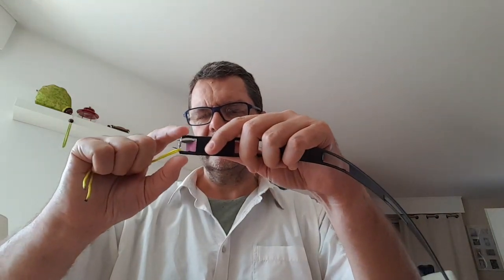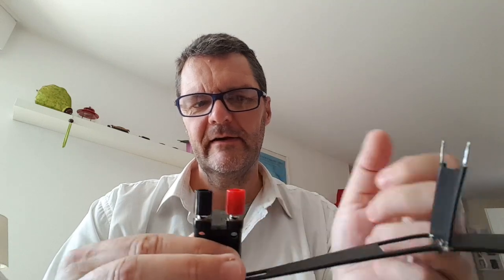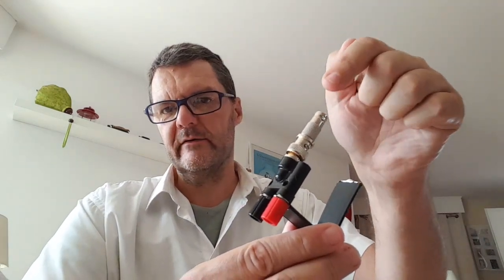The feed point — we go to the end of the antenna and it's shorted here on the end. You'll probably wonder how do I connect this to my radio? I use a BNC connector — it's a BNC to post connector and it's made so that it fits exactly the spacing of the ladder line. I also have a double BNC male connector so you can connect your coax right there.